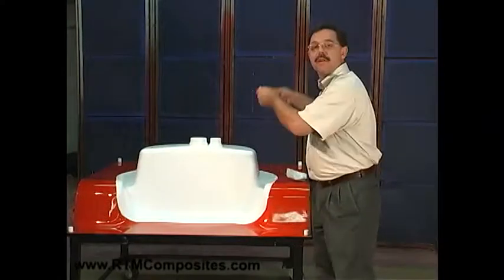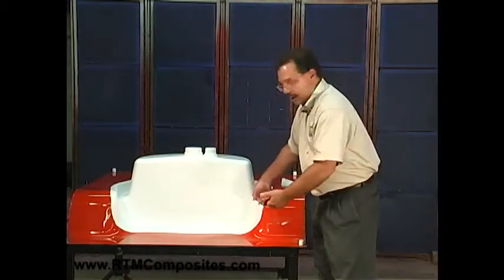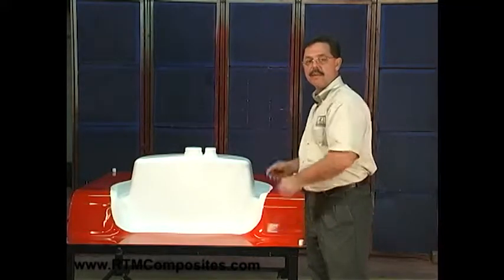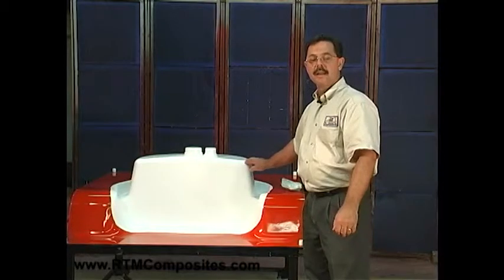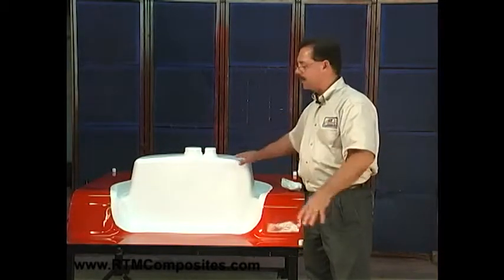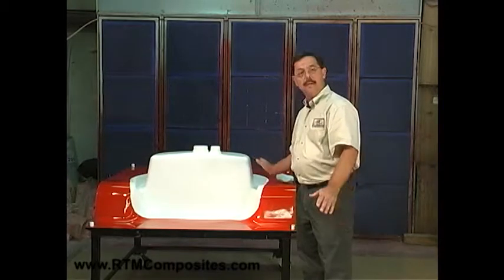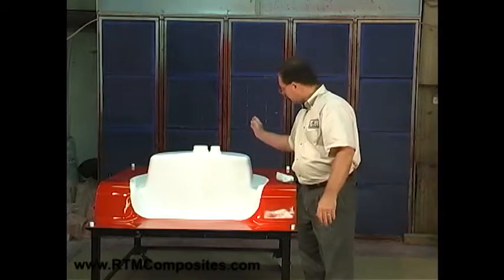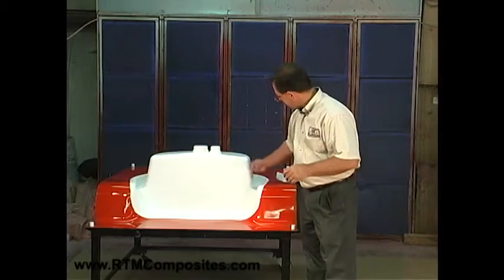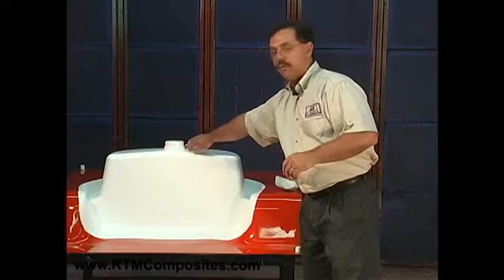What we're demonstrating today is not die-locked — the mold simply comes apart and the part comes off without being locked. If the shape were hourglass-shaped it wouldn't slide straight up out of the mold, so all surfaces here avoid that. That is an important design feature when considering parts for this process. Draft angles should be at least half a degree, but we prefer two to three degrees of positive draft, enabling parts to slide off most easily. Straight vertical walls can be problematic. This mold has a tremendous amount of draft, making it very easy to demold.